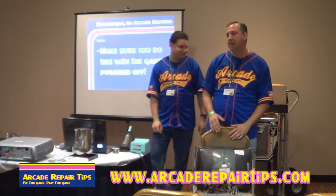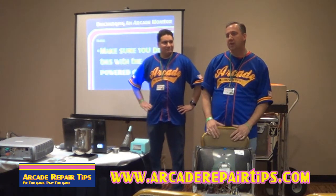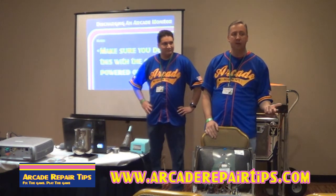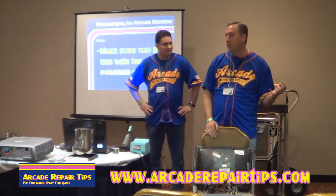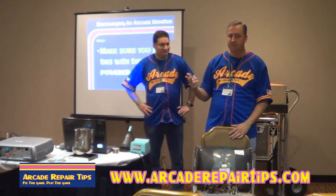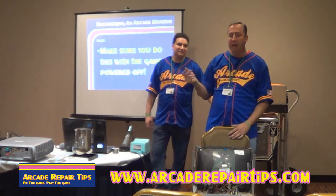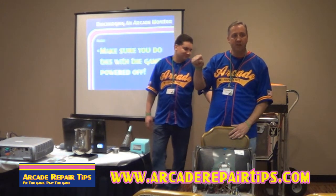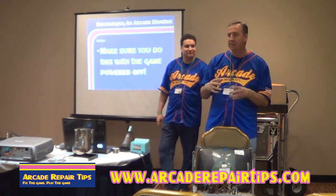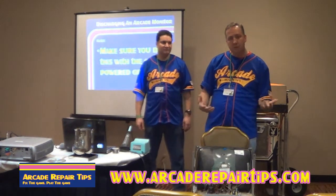I do recommend that you have rubber mats in your game room or work area. Remember what I said, what do most games operate on? If we hook up a power supply, we hit 120 AC, and what kind of DC voltages are coming out of there? 5, 12, and negative 5 on 99% of our games. And how much is that static shock? Could be 2,000 volts. So imagine what even just the static could do to your circuit board or your game. So we do want to be careful.